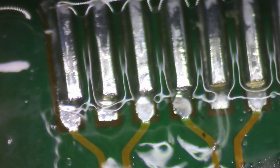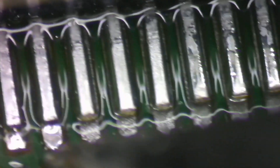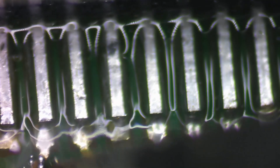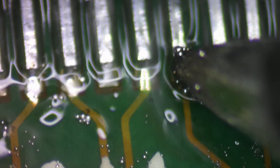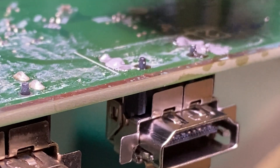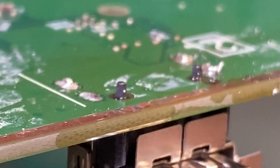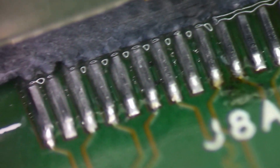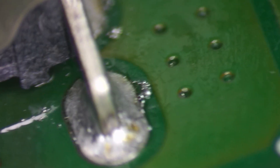I'll take some new solder paste and carefully approach each pin and deposit more solder, doing one at a time, making sure that each one is nice and solid so we don't get any bridging between them. This will guarantee a strong joint and a stable image. I like to see a nice little ramp of solder going from the tip of the pin down to the end of the pad — maximum solder without bridging two pins together. If you bridge two pins, it's easy to separate them with wick or the right tip. Now I'm going to add some more solder paste and heat it from behind, allowing the solder to flow through the holes all the way to the other side of the board. We now have nice shiny solder all the way through on those pins — plenty deposited without any bridging.